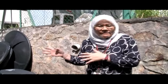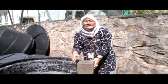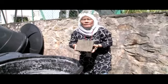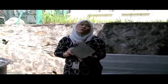After 14 days, before you start your laboratory practical number 4, you have to come in at least 2 hours earlier. If your lab is in the afternoon, come in the morning, say 8 o'clock, take the concrete cubes out and leave them to dry. If your lab session for laboratory number 4 is early morning, my suggestion is that you come in the afternoon a day before, before you leave the campus, and take the cubes out to dry. You need to ensure that they are dry before you proceed with your laboratory practical.